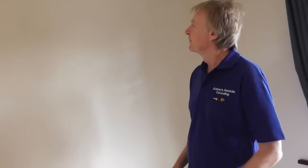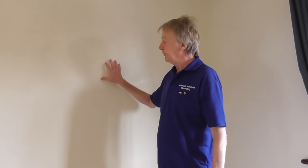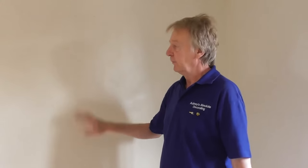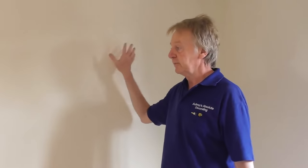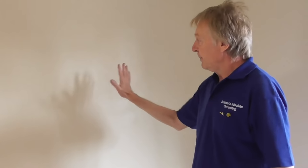Right, so that's it. All the paper is off the wall now - good job. What we're left with on the wall now is the paste which was used to stick the paper on, and that's got to come off now. Because if we don't and we just paint over the wall with emulsion paint, as it dries it will all crack and fracture and we'll get a great big crocodile skin effect. So we've got to get that paste off.